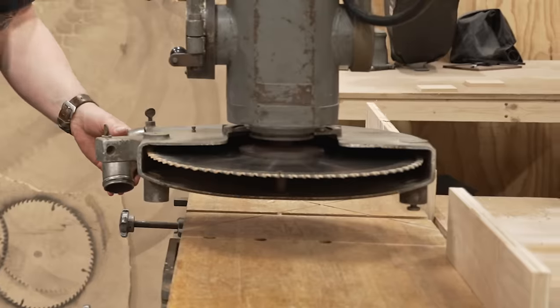Forget those. This is the final cut. This is probably the dumbest and most dangerous cut. 90 degree blade on the outside of the table. As you take your material that's too long for your fence, you run it on the floor and you run it through like this. You build a jig to hold it up vertical. Fortunately for you guys, I'm not that stupid and my saw actually can't do this cut. Whoever owned the saw previously rewired it here, and so this is as far as I can get this saw to come out. But you'd extend this blade as far out as it'll go and then run that board vertical on the floor and like either resting on this or something insane.